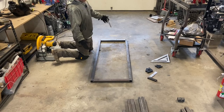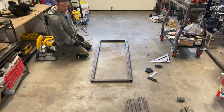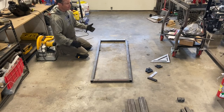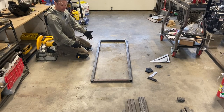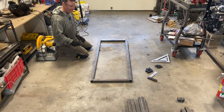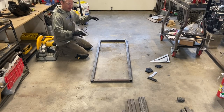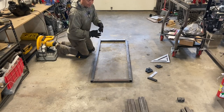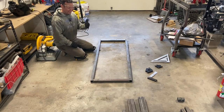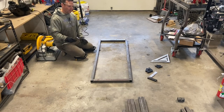A perfect square is a perfect start to a nice square chassis, which is what you want. If you try to build something without a jig or an alignment table — which I don't have — I'd much rather build a jig than have a big giant table in here, to be honest. It's going to make your build so much easier, even if you're not building one of these. Try to figure out a way to make a jig so all your stuff lays down with the exact measurements you want. It's going to make your notches fit together and your cross members tighter.